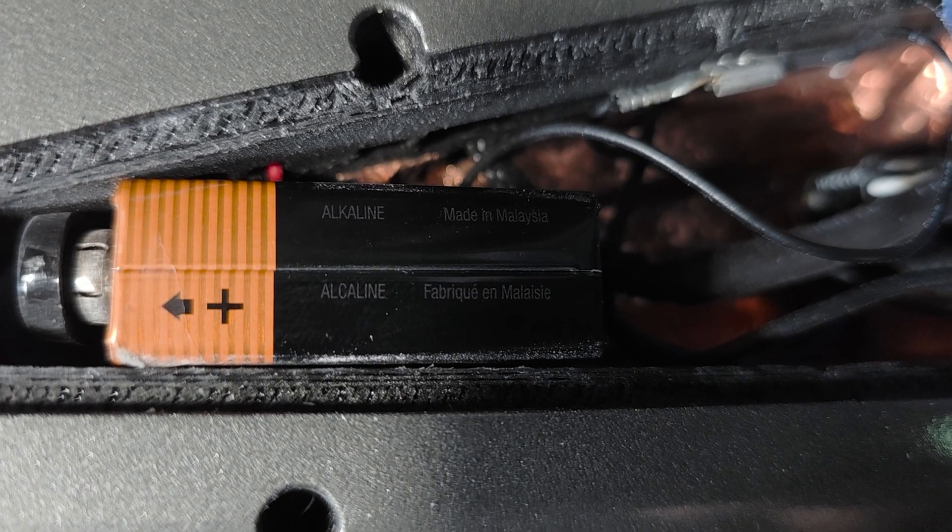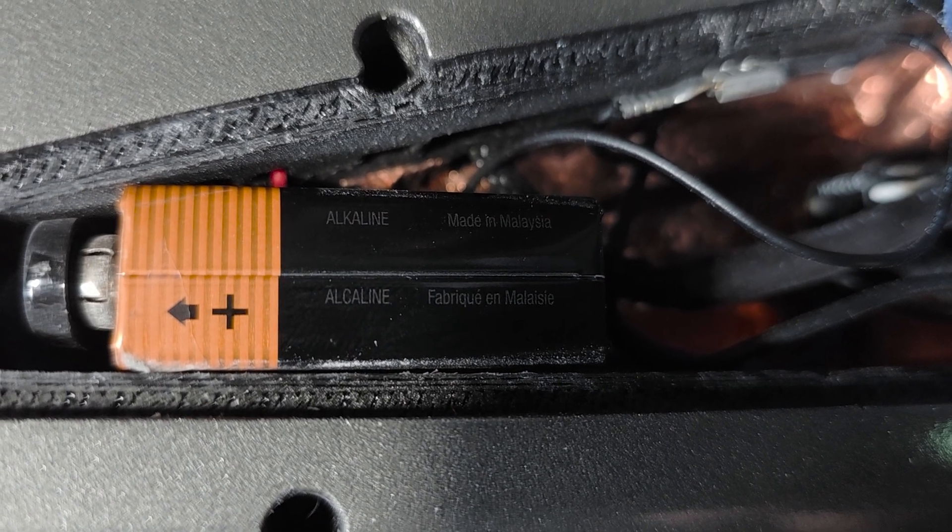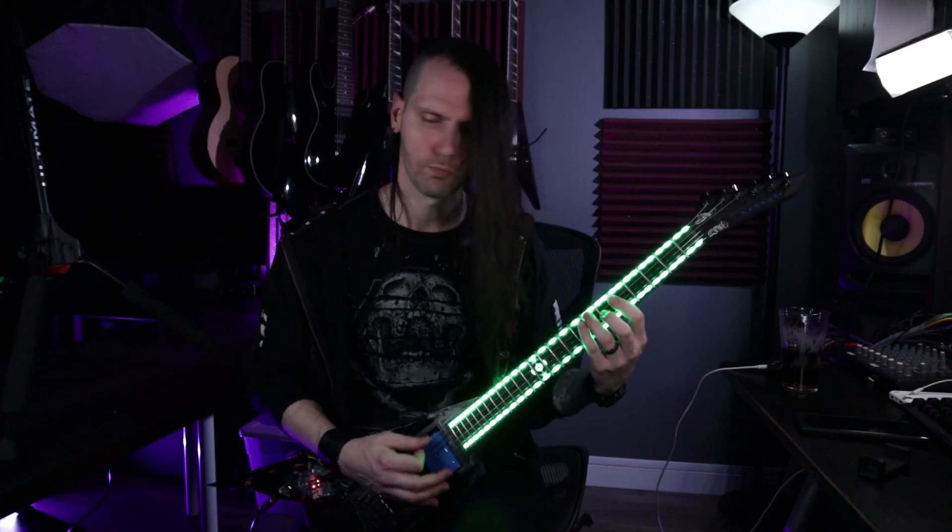But the reality is, if I just put the pickup on a separate battery, it eliminates even more noise. So basically we've got three different areas to target: one, the capacitors; two, EMI and the positioning of things in the guitar; and three, the power circuits. If I tackle all of those, I'm pretty confident that I'm going to be able to get a reasonably quiet guitar — maybe I wouldn't be using LEDs while I'm recording. This should work, which is kind of a big deal, because you want to be able to make more than just screaming sounds with a guitar. So that's where it is right now.